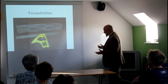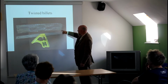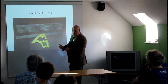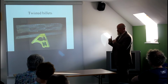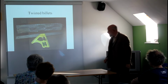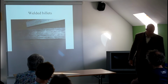And you need to bear in mind that once you start to work this blade, it will change shape because you're fullering in the middle, so you're moving metal to the edges. So some of these are marginally thinner than others. So you might narrow it at these points because when you put your fuller in, you'll move it out a little. So they're not just making these uniformly, they're making them to a mathematical formula. Basically, I think they've got a table where they draw it up and they know exactly what they're doing. They'll work it out and they'll waste it and then make it so that you can move the metal to the right place. And you know, they're phenomenal. Well, yeah, you've probably worked out I quite like them.